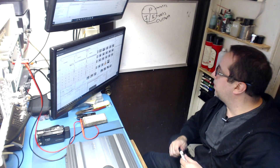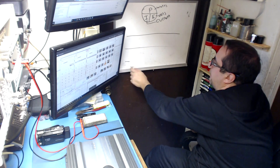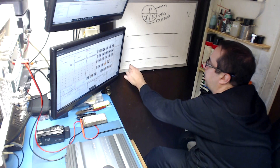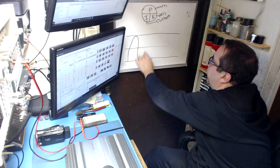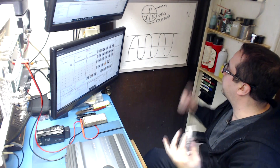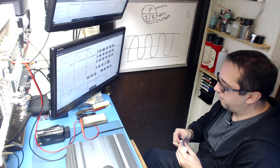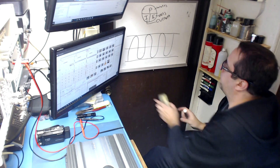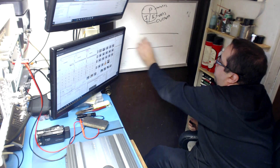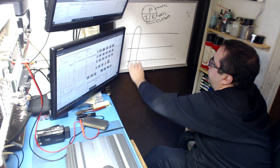Let's talk about the clipping portion. You've got your zero, your positive 49-volt rail, and your negative 49-volt rail. Now if you're running this thing at 900 watts full tilt, you're going to get a nice clean sine wave from plus and minus 49 volts. It's going to sound beautiful, it's going to be loud, it's going to be great. You're running it at 4 ohms — you're all set. But the second you take that signal and push it into distortion or clipping, you're doing something very different.